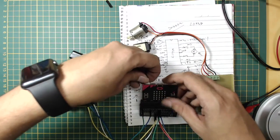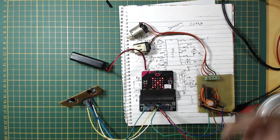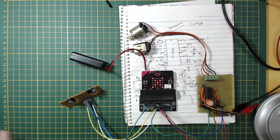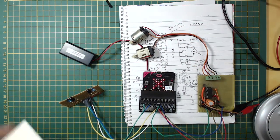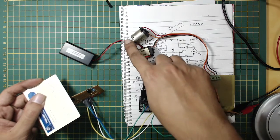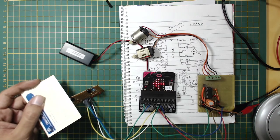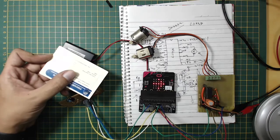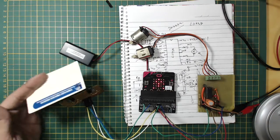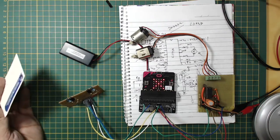I've already uploaded the compiled code — it's just drag and drop. The micro:bit boots up: with nothing in front of the sensors, both motors are off. Placing a sensor trigger on one side causes the left motor to run. The right motor also works independently, and triggering both sensors makes both motors run forward.